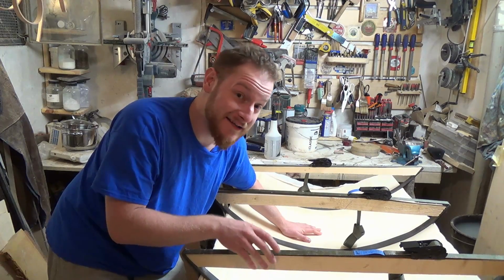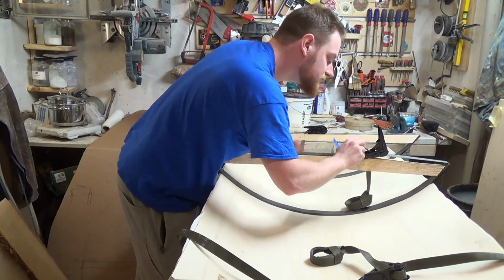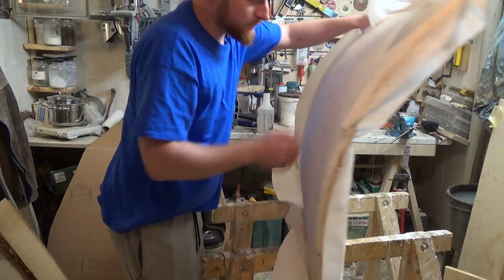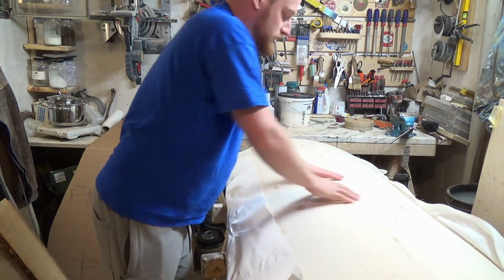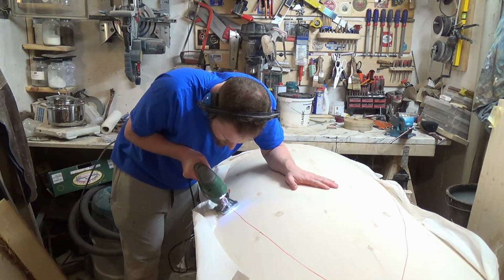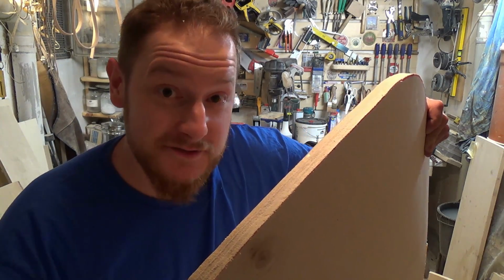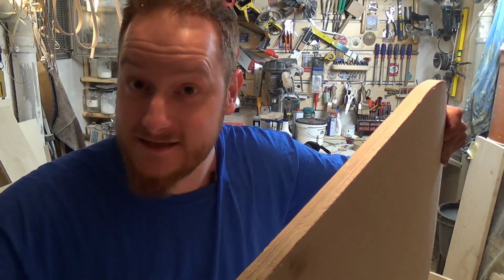Over 2 weeks have passed now. Let's remove the straps, then trace the shape and cut it out with a jigsaw. The problem we're gonna face now is the unevenness of the edge though, and it doesn't matter which blade you use, you'll always have that problem. In my case, I'll use the electric planer, which is just the fastest and best tool for that task.